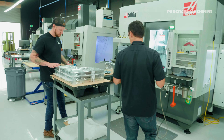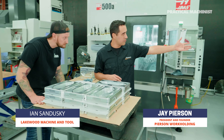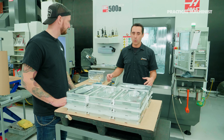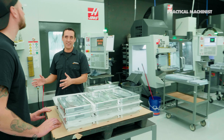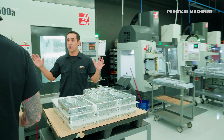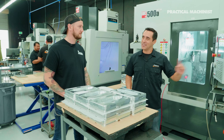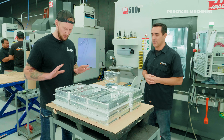Right here is a great example - this just came off next to the VF-2SS, so it's ready to go. We want to be working in U-shaped cells. We don't want to be walking or bending over, we want to be pivoting - super efficient. All the cells where we work, we call them cells, they're going to be U-shaped. The reason this one faces that way is because he's going between these two machines, and that's why everything's on wheels.